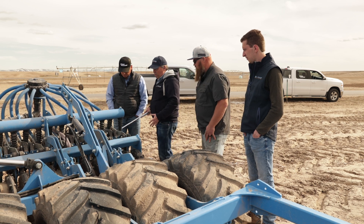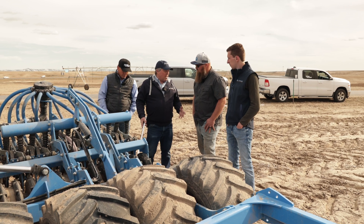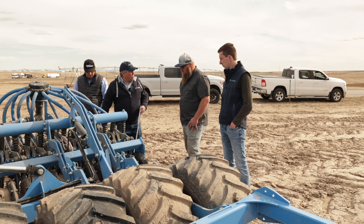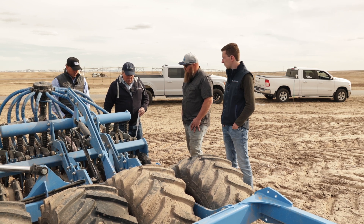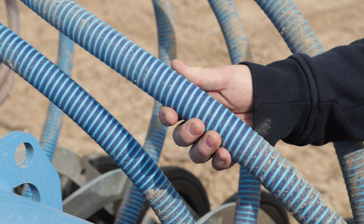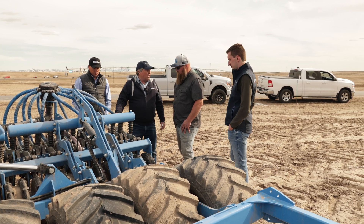We have our tried and true hydraulic down pressure with five-inch row spacing. So our trapeze packer roller is at the five-inch, giving us that nice firm seed trench right in front. You've got ideal seed-to-soil contact. Each one of these row units still has the independent parallel linkage, so it's going to trail real fine. We also have larger diameter hoses now so we can handle more volumes of material. When we add cover crops, or with the two-bin capacity, we can do fertilizer and seed in the row unit, giving a lot more flexibility with this larger hose design.